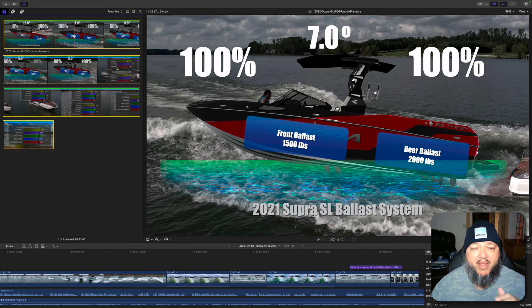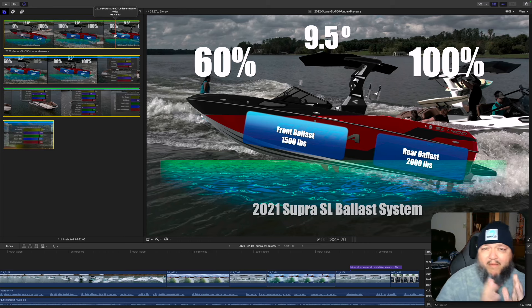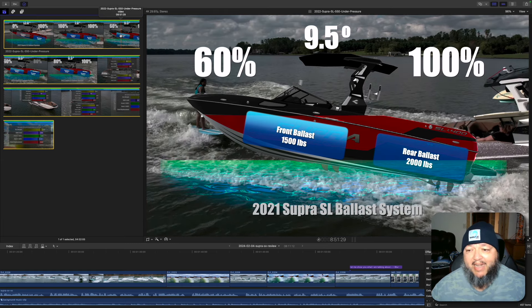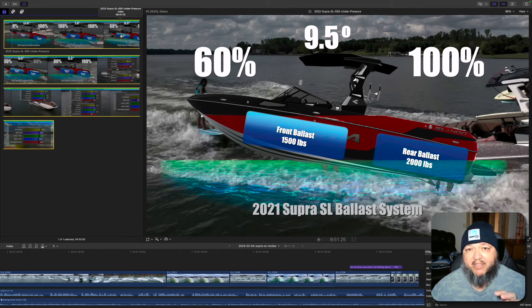You can use plates and other things to help, but the best way to adjust pitch is to adjust your hull with weight. If we take water out of the front and get to 9.5 degrees of pitch, we have a much better wake — even though we let 40% out of the front. Pitch is more important than a few hundred pounds of lead or water. This is why we use lead: if you add lead to the back of this boat, you can fill up the front and still be at 9.5, maybe even 10 to 10.5 degrees. It just depends on your taste.